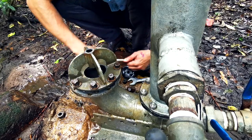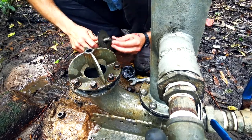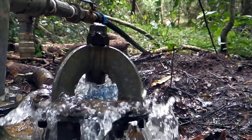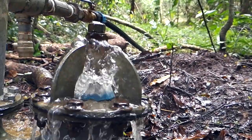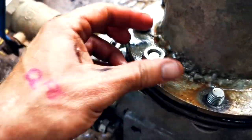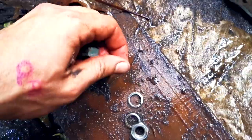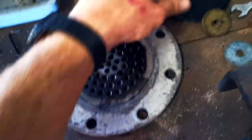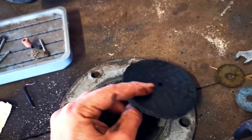But what we end up with is this sort of effect — this thing here, and your constant, that's your valve. This is the one one-way. And the other one-way valve is inside here. All it is is a plate with a piece of machine belt on top of it, with a bunch of holes underneath so that water can come up through it but it can't go back down through it.